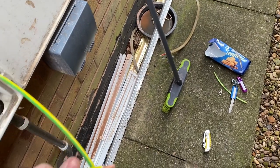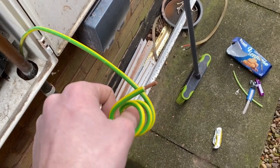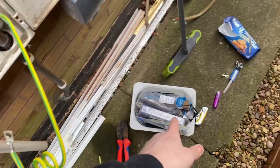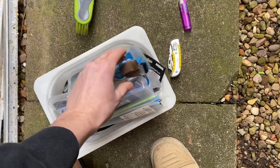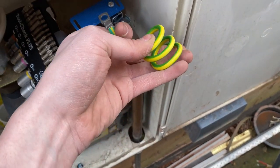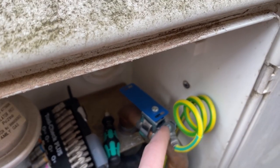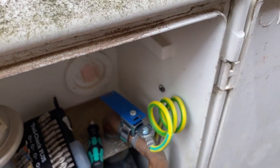You can get heat shrink guns — we did have one but it was a 110V one, so you'd obviously need a transformer to use it. This is a real-world situation: we don't have any bigger heat shrink, this is the biggest we've got. We've used it all, so not a lot I can do about that. But obviously that's going to go back on there. It's a bit of a shame but it's screwed on now, nice and tight using the washer — it pinches the earth lug — and you've got a nice pigtail on it.